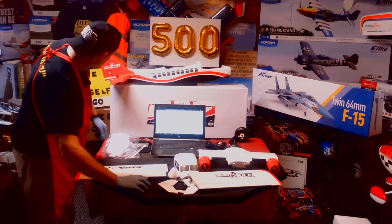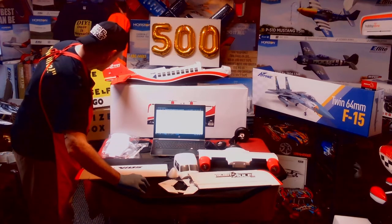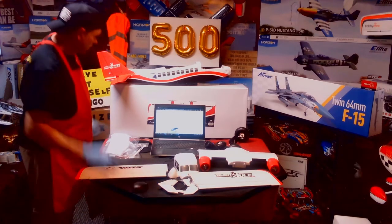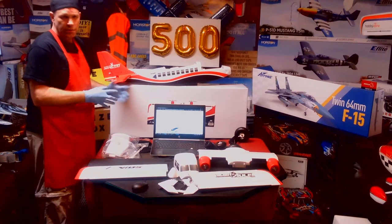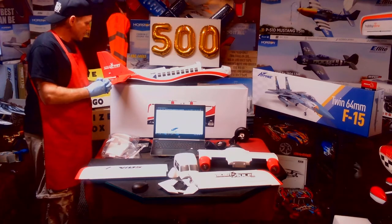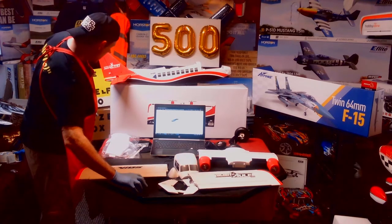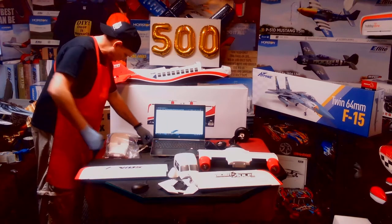All right, and then the next step is, if you have no need to remove these parts, here's where it talks about how you can glue them on there. Use the servo tester to center everything, but at this point I'm not going to worry about that. It's plug and play, so when I put the AR636 or whatever receiver in there, probably from a previously crashed bird, I'll let the AS3X settle up first, and then I'll adjust all that stuff. It also talks about using a little clip of hose to keep the hinge shut on the clevis, so I guess these do not come with that.